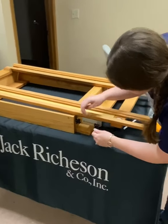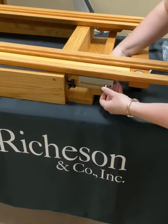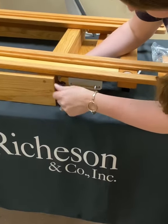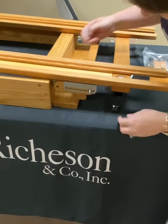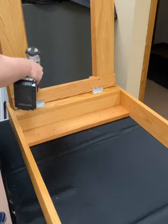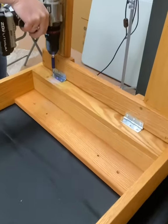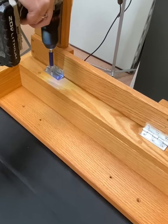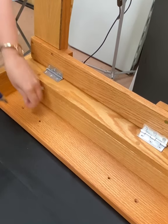To remove the H-frame, take out the connector bolts at the top of the frame. Remove both sets of bolts along with the tilt adjustment bar. Have someone stabilize the frame while removing the hinges located at the base of the frame. Only remove one side of each hinge — the side connected to the wall mounting frame.